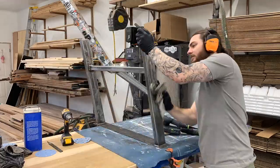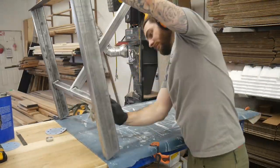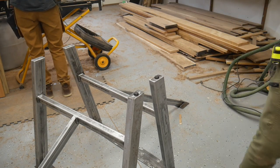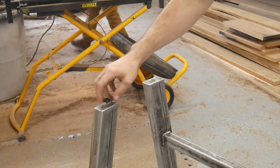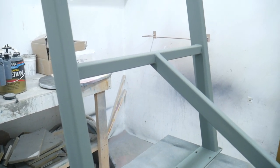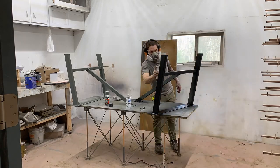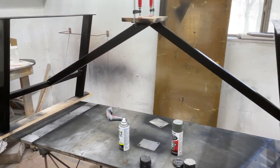Evie went ahead and did the final sanding to 150 grit and I got started prepping the base for paint. To do that I just use an orbital sander with 80 grit for final blending and then clean it about 400 times with acetone. I like to add leveling feet to any furniture I'm able to — it's just a nut rivet that crimps in like a rivet and gives you a threaded option. Furniture is never perfect, let alone the customer's floors, so better safe than sorry. I paint these myself — powder coating is definitely the best option but I don't have one nearby. I do two coats of self-etching primer and then any decent quality spray paint will be just fine. Add a couple clear coats for extra protection, and don't lay it on too thick as it won't cure properly.